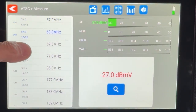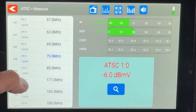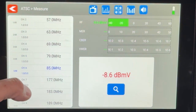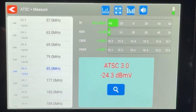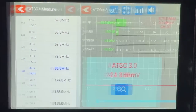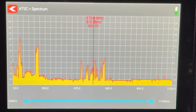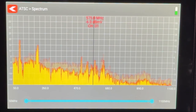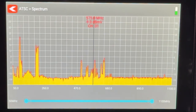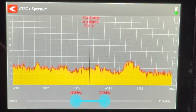A quick note: I did these screen captures by pointing my phone at the tablet screen, so there's a little distortion — that's not real. As you can see, you can look through any individual channel and get all the measurements you need to aim it, including digital channels, and it reads ATSC 3.0 really well. If you tap here, you'll see a scope that gives you basic spectrum analysis in real time — it updates about 15 times a second, which is certainly enough.